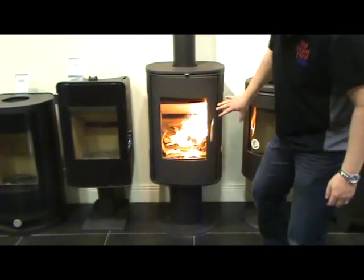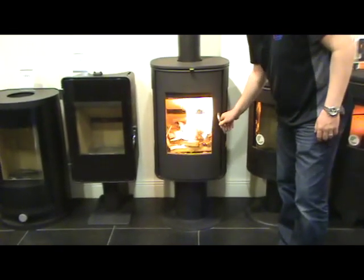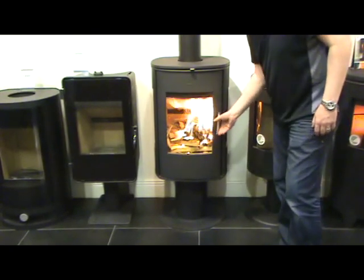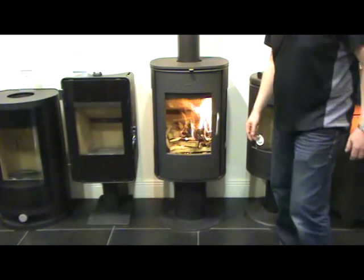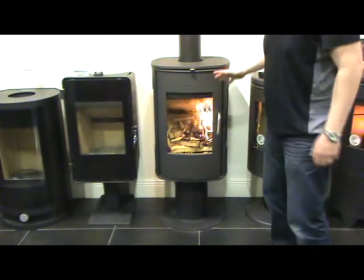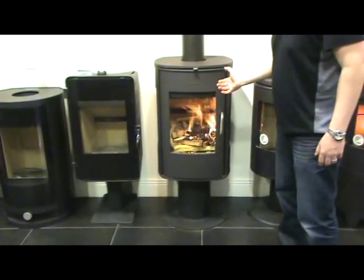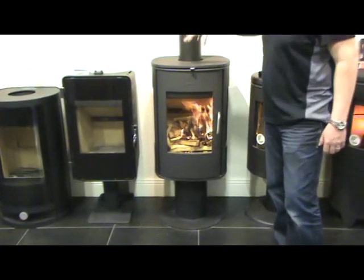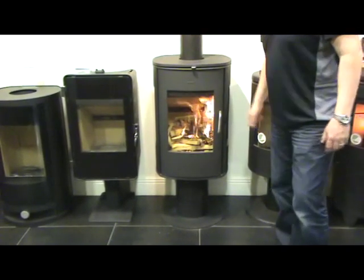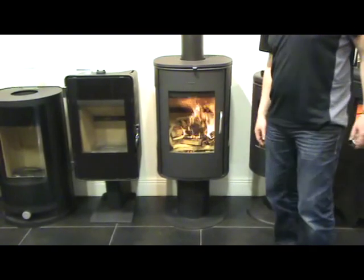I think our pre-fire is probably okay here. What I'm going to do is just close the door and let the stove take care of itself. We can see immediately when we close the door the fire does die down. This is because we're now just relying on the preheated secondary and preheated tertiary air — hot air coming from the stove. We should have a good enough fire established for it to take over.